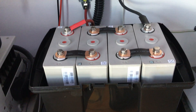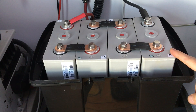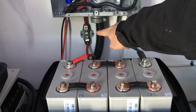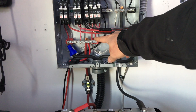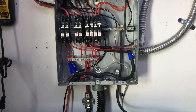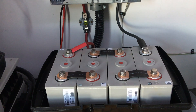This is a very first impression and I'm quite happy with that. Four cells in series, 180 amp hour, 12 volt — it just goes through a fuse into my bus bars. There's the fuse right there, into my bus bars. This is just a really simple, easy setup; it will change a lot. I'm going to have meters on every single one of these cells so that I can read them individually.